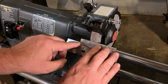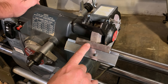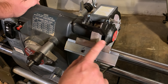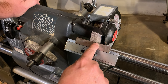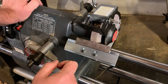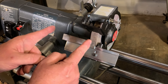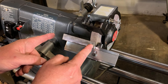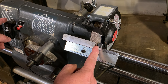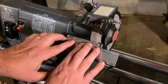With our knife, we put it up here and adjust the angle. Having an angle gauge would come in handy so you could adjust the tool rest before installing the jig. Slide all the parts into position. I'm going to pantomime this because I'm not going to ruin my sharp joiner knife. This uses the standard Shopsmith 5/32-inch hex wrench. We would slide the blade up to where it's making contact with the stone and then tighten the cap screw — though it wants to shift as I tighten.